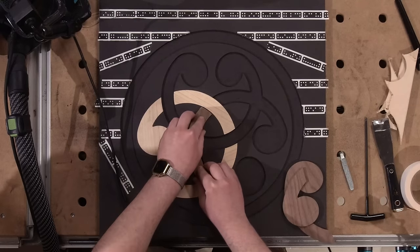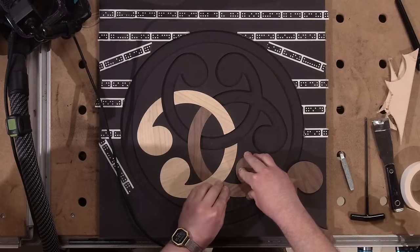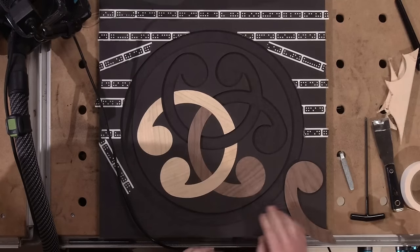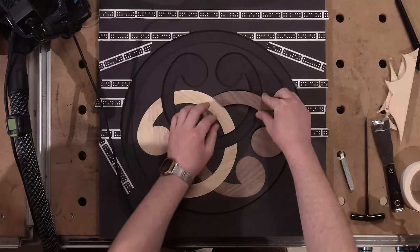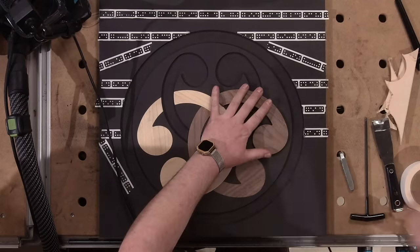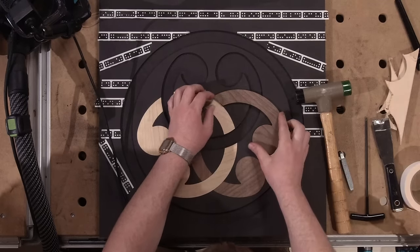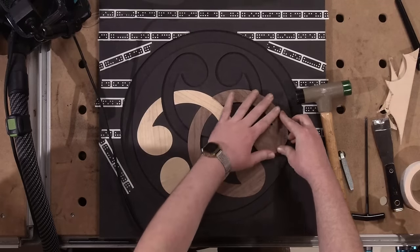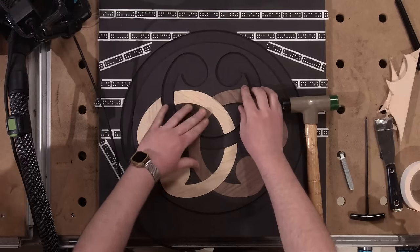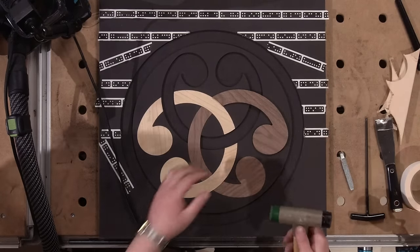Let's do walnut here. Wow. That's snug. Nice and creaky. That 0.01 makes sense because that's an interface between two parts, and you did 0.012 on the pocket. 0.012 was what you needed for the pocket to fit. Yep. And so you probably could have even gone 0.012 on those secondary interfaces, right? Probably. Just kind of carrying that over.